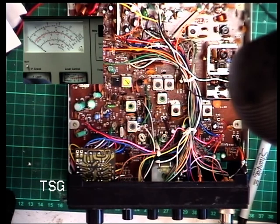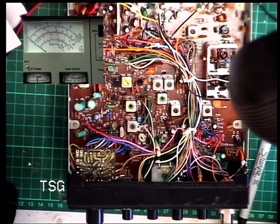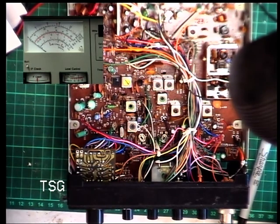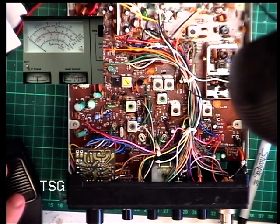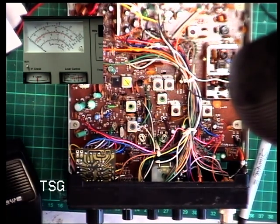What they have said, you wouldn't believe they've put in a service manual: with a sustained whistle into the microphone, or feeding a 1 kHz audio tone, or just the preset VR4. So they actually said whistles is adequate, which it is. But it's repeatability that we use the oscillator. I think that's it. No, we're done.